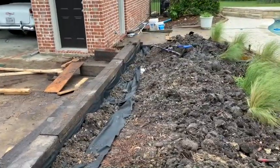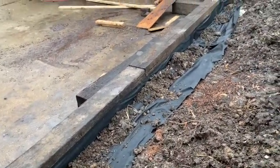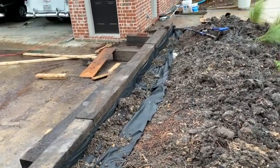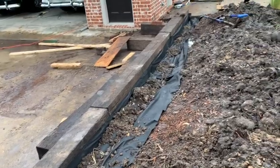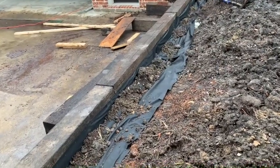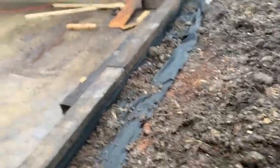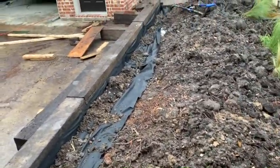So here is the next step of the project. You can see we took the landscape fabric and came in there — we covered the drainage tube and the gravel and we put this in. Hopefully this will keep roots and things from growing into the drainage ditch. The gravel should allow the water to flow and not puddle up, and the landscape fabric on the back of the railroad ties should give us a nice line to grade to, with about an inch or two sticking out. Right now it's just mud and gumbo — you can't even get it off your shovel. So it's about all I can do for today. I'll clean up the project, get reorganized, clean the driveway, and we'll get ready for the work week. Thank you guys, glory be to God.